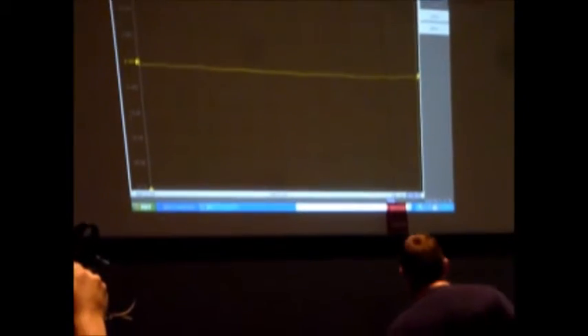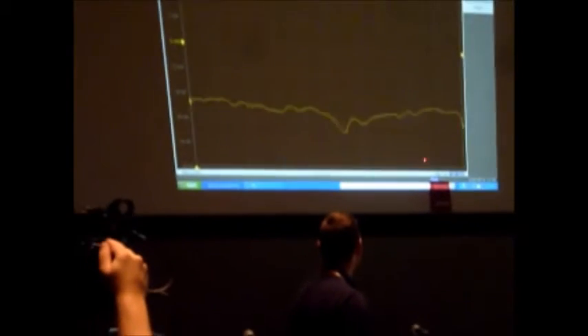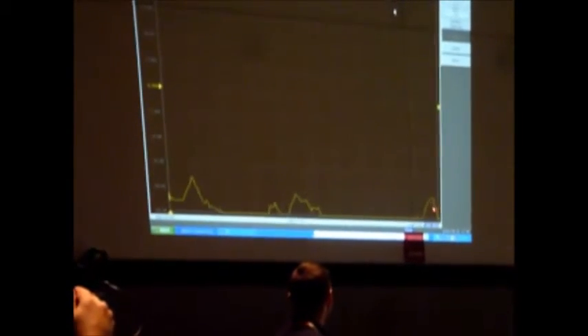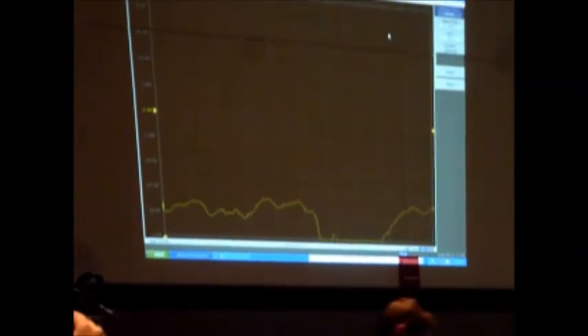You can see that Justin's down — how far are you, Justin? About 15 to 20 dB. Now, the problem of course is when you get down there it gets a little rough because the signal-to-noise is actually kind of low. It is a network analyzer with a fairly low power.